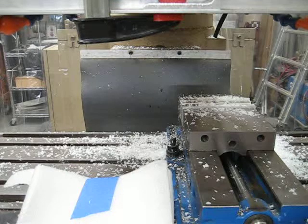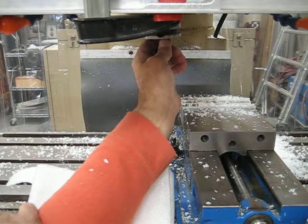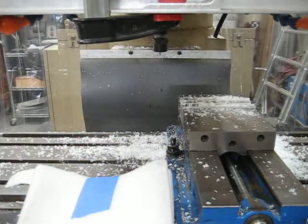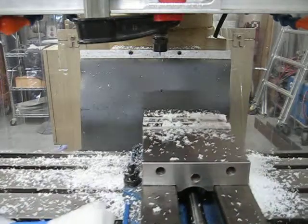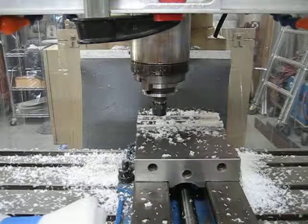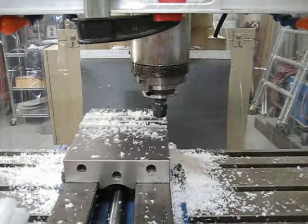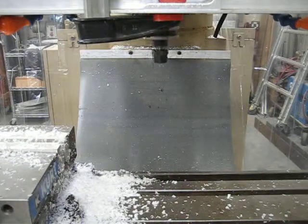I'm using a bolt — it's a small end mill. But I found that the smallest one I have makes too wide of a groove. So what I've done is orient it to where it acts like a knife, and I don't even turn the spindle on. I just drag it across the part to get a nice hairline pointer. You might be able to see it curling up some small chips. And that's it.